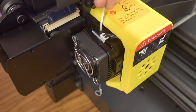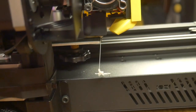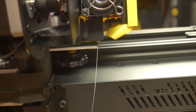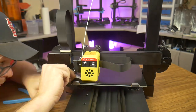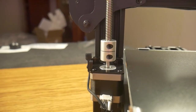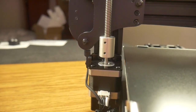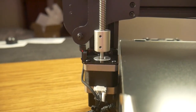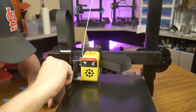It took me a minute to figure out how to load the filament. There are no tensioning knobs or levers to assist you. Once the hot end is up to temperature, you just push the filament into the little hole and press the load filament button on the touch screen and the printer takes it from there. Leveling the printer proved to be a little challenging — it seems like the Z height would change ever so slightly every time I moved the Z axis up and then back to home. I think it may have to do with the Z limit switch, which on this printer appears to be inductive or magnetic. It senses the Z limit without making contact, and I wonder how precise it is — even a variance of 0.1mm could mean the difference between a successful and a failed print.